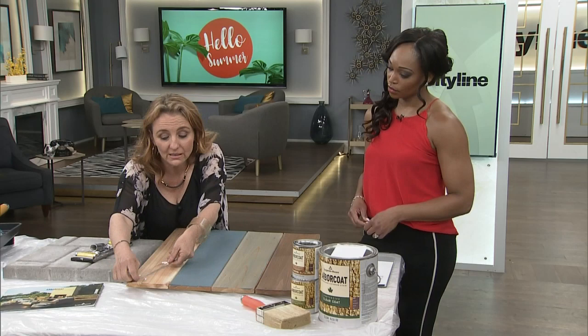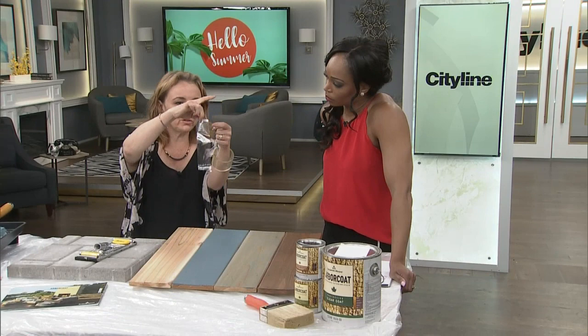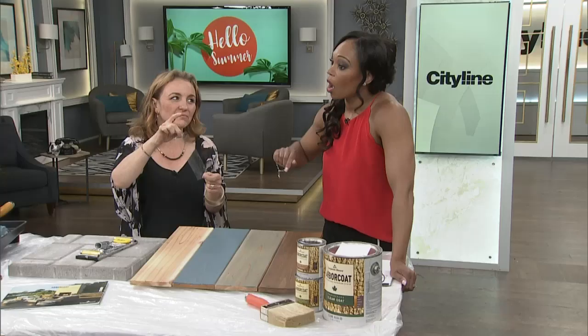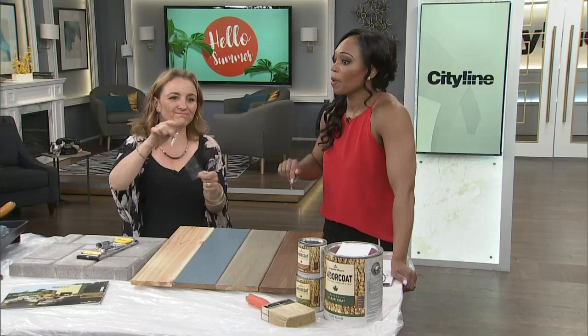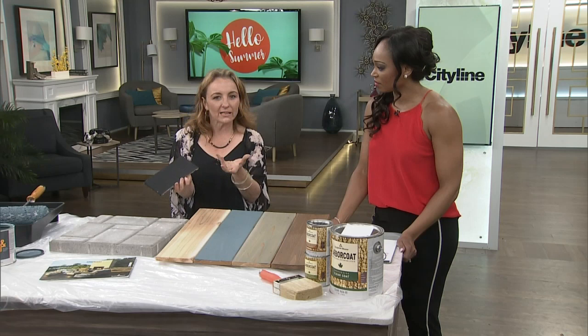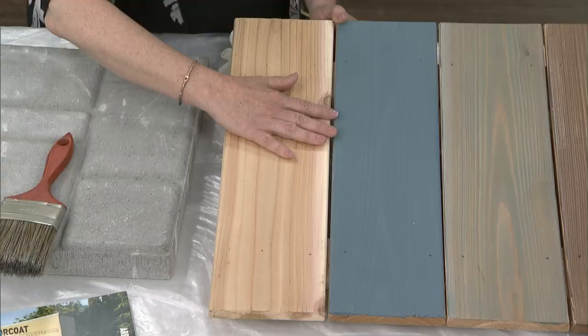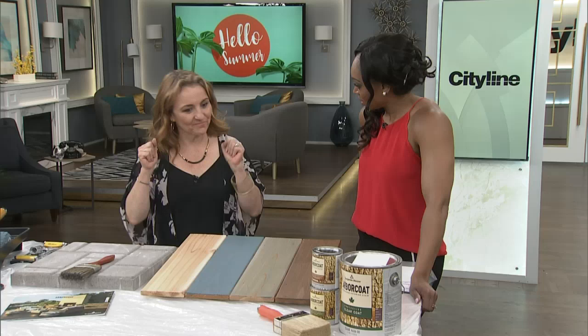You can do a little test if you're not sure: put some really strong packing tape — not painter's tape — on there, pull it off, and you can see wood fibers come off with the tape, which means you need a better sanding job. It's a really good idea if you want the best result. Just pick an area and test it out, then use an 80 to 100 grit medium grit sandpaper — it's really quick, you're not doing a lot of work.